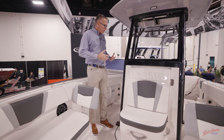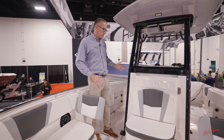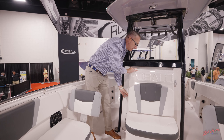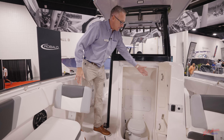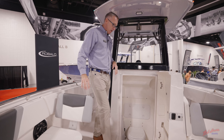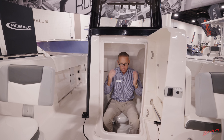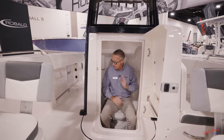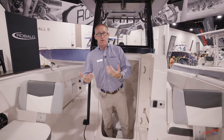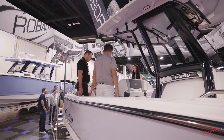A lot of manufacturers use a 15-inch side door to access the head on a center console, which can be very difficult to get into and forces a higher helm design that affects visibility and ergonomics. Robalo instead comes through the front, giving you 22 inches of space for access and a deeper head compartment that's much easier to get into — wider and a lot more space. There's headroom, a window, and a light inside, and it can be equipped with an electric head with overboard discharge.